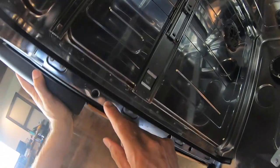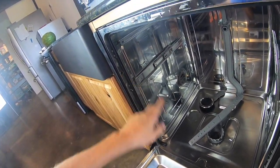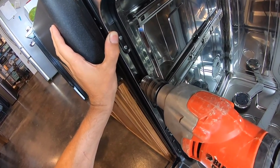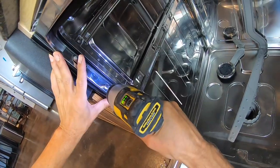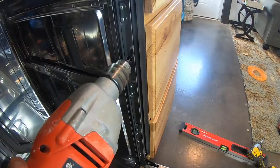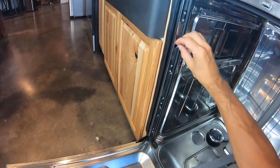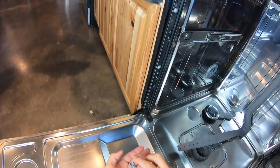With the door open, there's a little access hole to reach the bracket on the back side. I'll use my drill to drill a pilot hole through the bracket and put my screw in — that felt tightened up. Do the same thing on the other side. Now that it's anchored, I need to plug these three access holes with the provided plastic plugs, just so no water will get through there — even though there's a seal on the door, it's just in case.